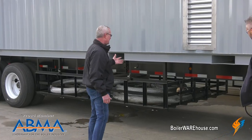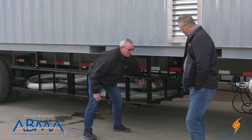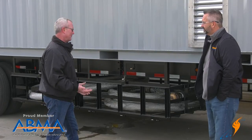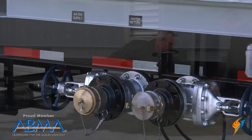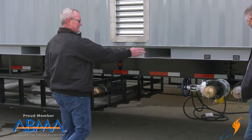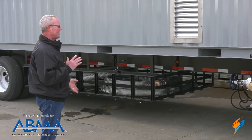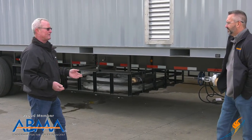When they move this stuff around, if you don't have plugs in those hoses, they get full of debris — rodents and everything else can come in there and build a nest. So we did the same thing on the connections here: put plugs in there and caps on them. We crisscrossed them where the return has a female cap on it and the supply has a male plug, so they can't switch them up — they've got to put them the way they're supposed to be. We just did a lot of things to make it really error-proof and easy for those guys to work on.